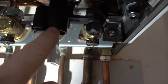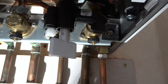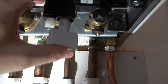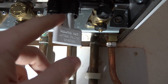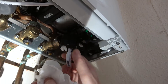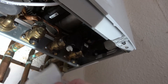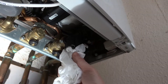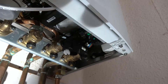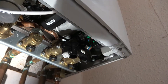And now I'm going to go from the locked position to the unlocked position, and I'm going to get a cloth when I pull it out. There will be a bit of water that will come out. Now, if you don't insert this key properly, water will come flying out of here. So make sure that you've only got an eighth of a turn from the unlock to the lock position. I've got my cloth ready and I'm just going to keep it on the unlock position and take it out. It's very stiff to get out. You can see a little bit of water has come on my hand and there will be a few drips. So obviously if there's anything important underneath, make sure you have a bucket or a rag to mop it up. And that is it. You can then put this in a safe place or put it back in the cover at the bottom if you have that. And your boiler is now pressurized.